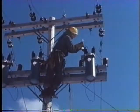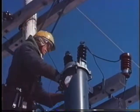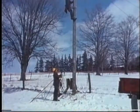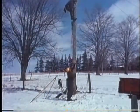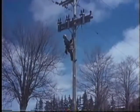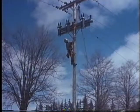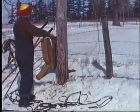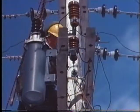When all reclosers are isolated, the drop leads may be removed from the reclosers by hand, care being taken that the tails don't contact the live conductors above. When all phases are bypassed and the recloser is isolated from the line, the recloser is ready to be removed from the pole structure. A ten foot folded clamp stick is used to attach a block hanger to the cross arm. A half inch rope or a set of rope blocks is used to lower the recloser to the ground.